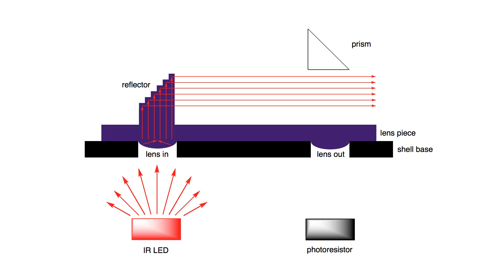The analog part comes from the stairs embedded in the reflector. When the switch is not pressed, the prism is situated above the height of the stairs, which means none of the light is sent downward, resulting in zero signal. If the slider is pushed down a bit, it will start to reflect light from the first stair, which results in a small amount of signal. The further the slider is pressed, the more stairs are reflected, and the stronger the resulting signal is.